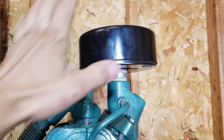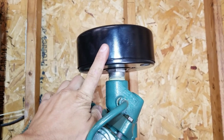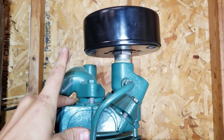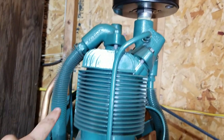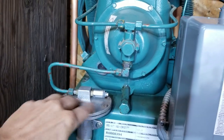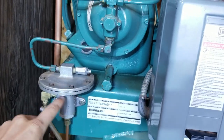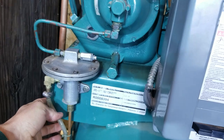Here's the setup from the top down. I got a washable air filter in here — I just washed it and reused it. I got the valves doing really well; I rebuilt these in that one video. Then we come down to this thing here — they call it like a saucer UFO shape. Basically when it's done running, it siphons a slug of air in here and siphons the moisture out the bottom of the tank and blows it out.